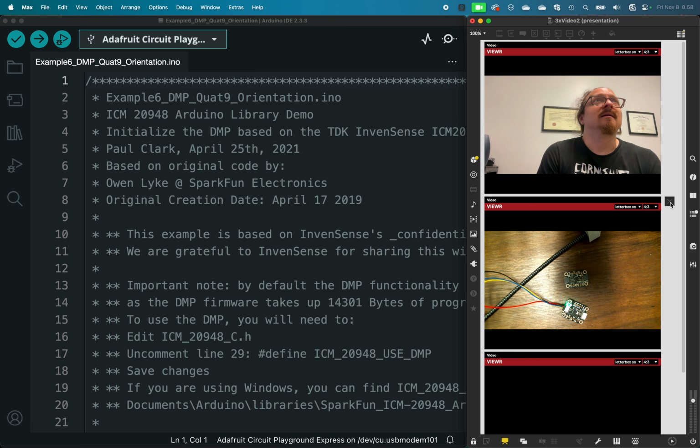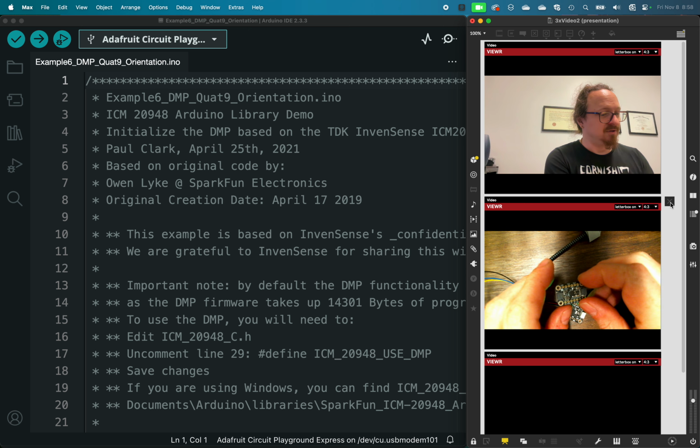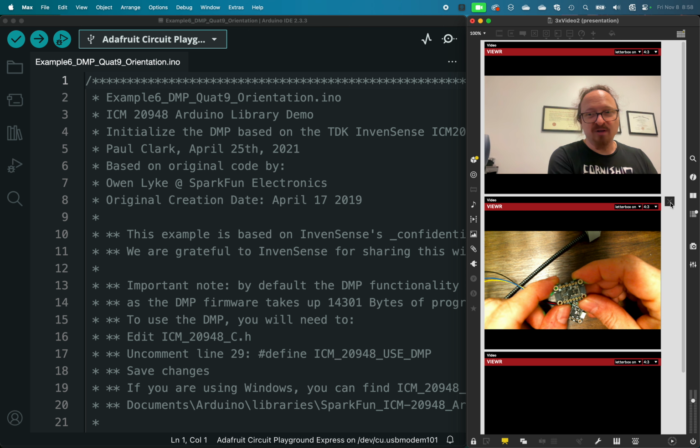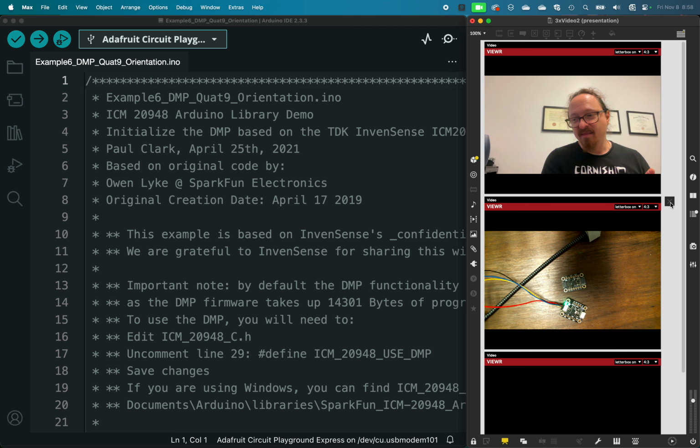That itself is a bit of a process that typically involves running a certain sketch on your Arduino, generating the calibration matrices for the sensor, saving that as a spreadsheet or a text file, and then uploading that into non-volatile memory like EEPROM on the Arduino, so it always has access to that calibration file, and then you can use the sensor. That in itself is a complex process.